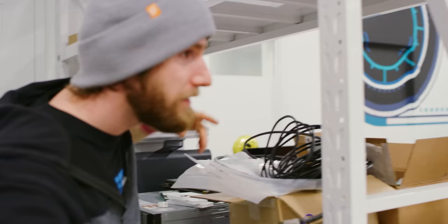It's cool though, they even show you the zone. So right in the middle there, you can see the little white speck. That's actually the light that's coming through the fiber from the other end. If you were to take a light pen and shine it up there, you'd have a big, big white spot. The actual glass part is just this inner ring there. And these are all just extra parts that are around it to protect it, like part of the ferrule. It's really, really zoomed in. For reference, the part that we're looking at in the middle is only 62.5 microns.